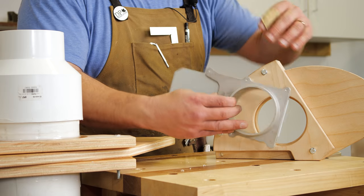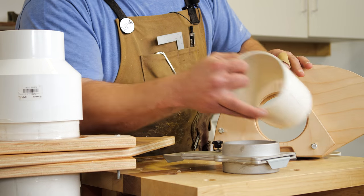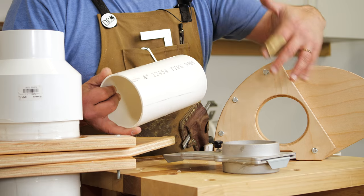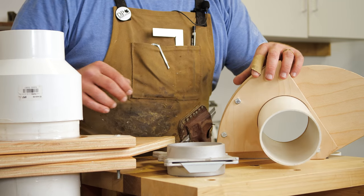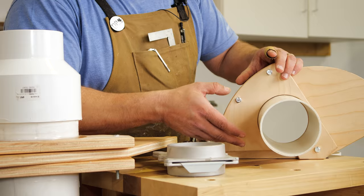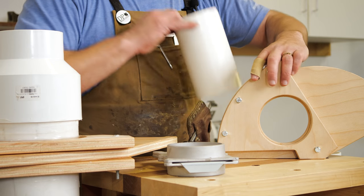The first one being the metal blast gates. You mount the pipe on the exterior. Mine you mount on the interior. They're perfectly sized, and the ring on the inside is the inside diameter of the pipe, and the rings on the outside are the outside diameter. And what that does is you stick your pipe in here, and that closes up the gap when the gate is open. So when you caulk your pipe in, as long as you've cut your pipe square, it seals that gap, as you see in the close up here, and it keeps any airflow from escaping.